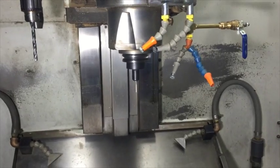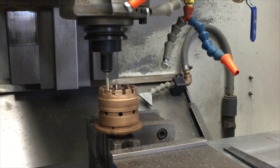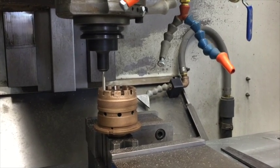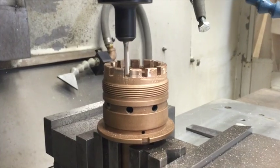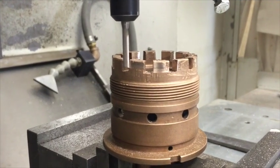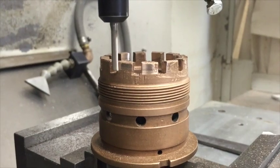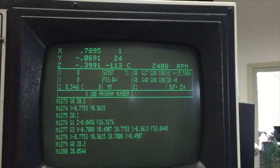We spin it real fast, and what we'll do is cut off about five thousandths on each side of all of the part, just to make sure that we know where all the little fingers are, because they got bent in all kinds of different directions when you saw the original piece. So we cut off five thousandths, we see how it all goes. You can see that the tool will cut across all of the surfaces — it just makes it so cool.